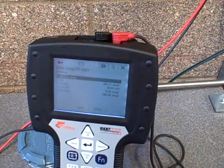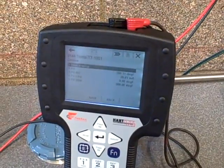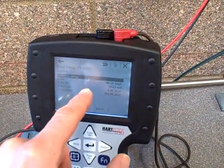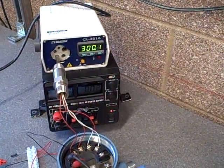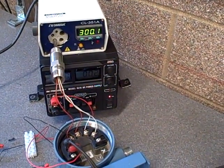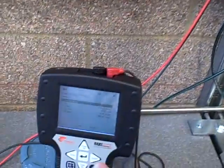So that's a good way to tell where a calibration problem is in a smart transmitter — by correlating the PV and the analog output values with real life known standards for PV and analog out. Our next check: we're going to change the temperature to a lower amount and we'll do a similar calibration check there as well, to make sure the PV matches at some lower value and also that the milliamps match at a lower value as well.